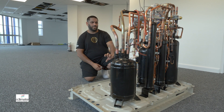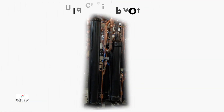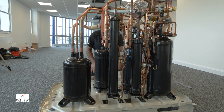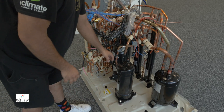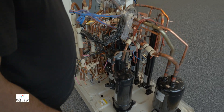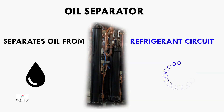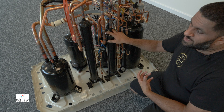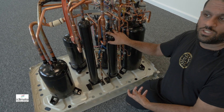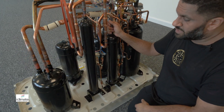The third set of components for this refrigeration circuit are the long, tall black cylinders that you see, and they are the oil separators. As with any mechanical motor, oil and lubricant is required to make sure that the mechanical side does not seize. We have a smaller compressor and a larger compressor, with a smaller oil separator and a larger oil separator, ensuring that oil is separated from the refrigerant circuit and always kept returning back to the compressor. If the oil does not get back to the compressor, we have a compressor failure issue where mechanically the scrolls will seize — a very costly repair.